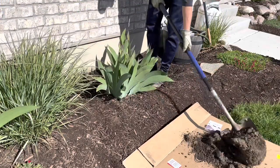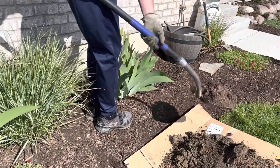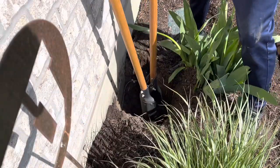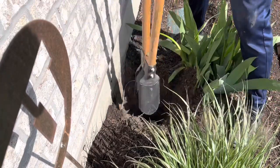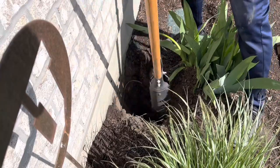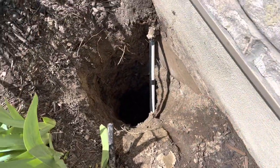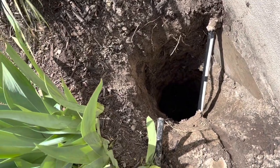Here I'm using some cardboard. This ensures an easier cleanup and makes sure that I don't get any dirt on my lawn. I also recommend using a post hole digger — this thing is a lifesaver and saved me a lot of time. So I've got my hole dug. It's about a little more than 32 inches; 32 inches was what I was going for, it's about 34-35 inches.